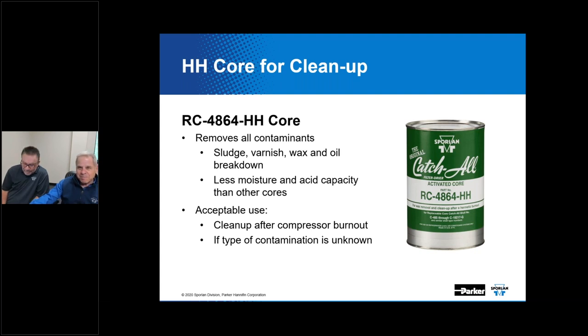All right. And then one final question before you push on. What is the effect of installing a filter dryer backwards? If you put it in reverse and it's not intended to be utilized that way, we do have some filter dryers that are bi-flow in nature, right? With a different internal construction, though. Right. The construction of it, and it would probably be best if I were to have the cutaway view of the filter dryer in front of us, but we have placed components inside the shell that are filtering in nature and then desiccant removal in nature. And you compromise that if you install it in reverse, if you will.